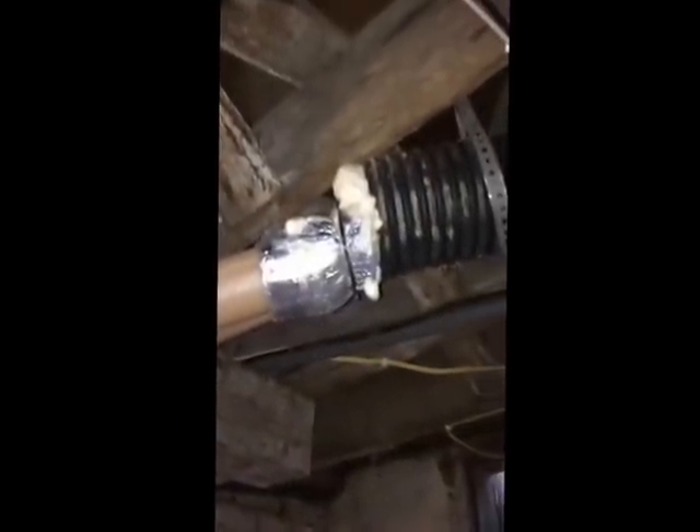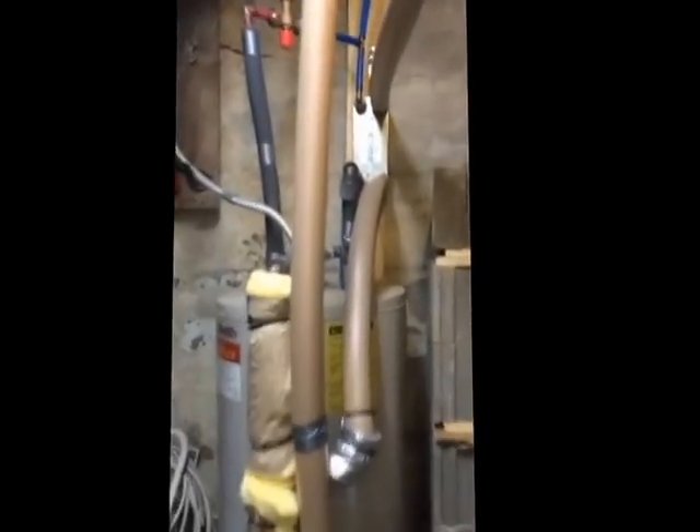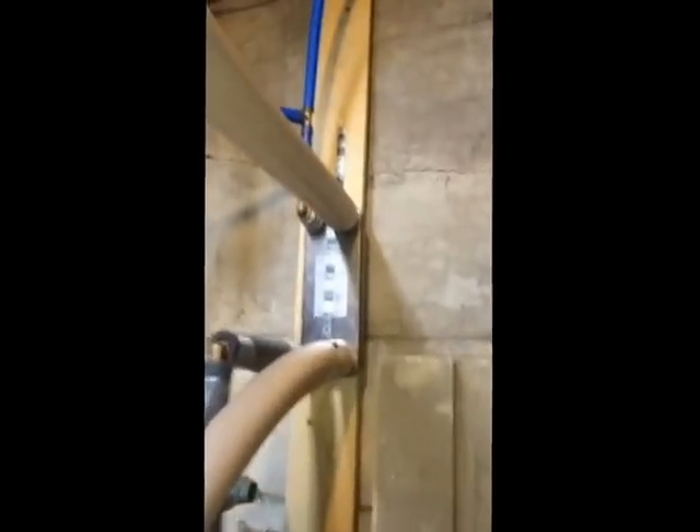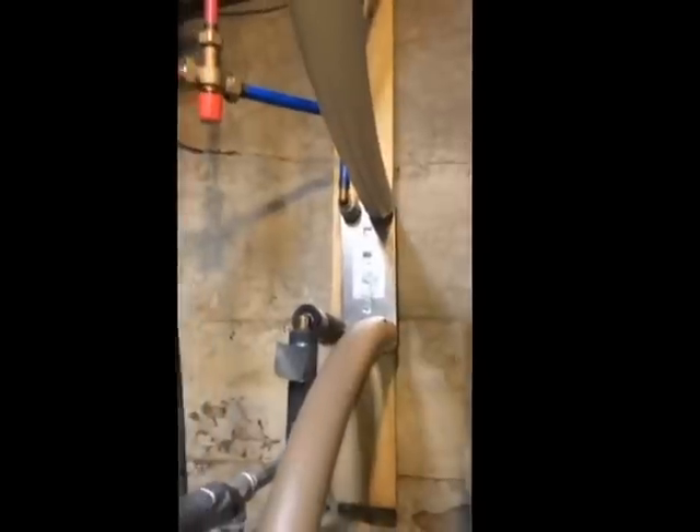When you come in my house, this is where my boiler pipe enters. It was buried outside in the ground approximately 18 inches. It comes in and follows a path over to my hot water heater. The water runs through a heat exchanger — the boiler water runs through there, and also incoming water to the hot water heater runs through there. The two waters are always separated but the heat is transferred from the boiler water to the water going to the hot water heater.